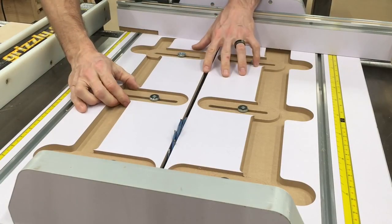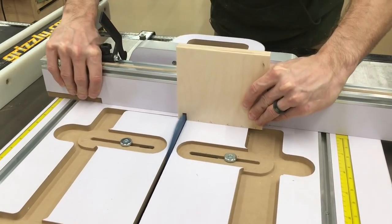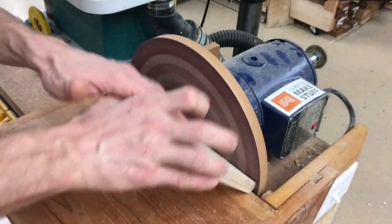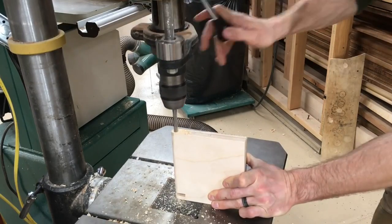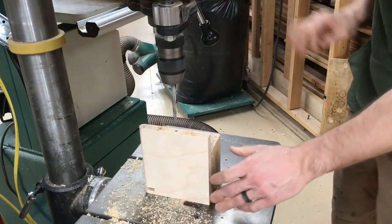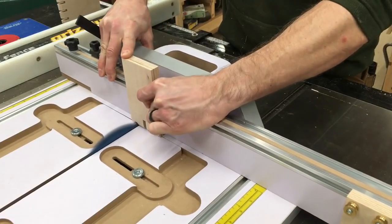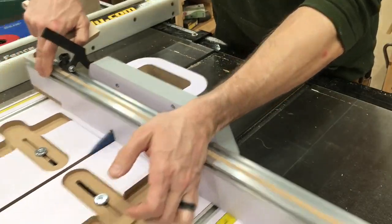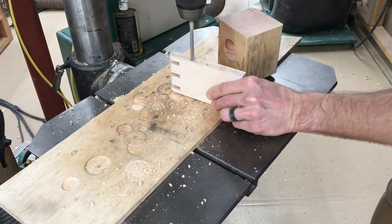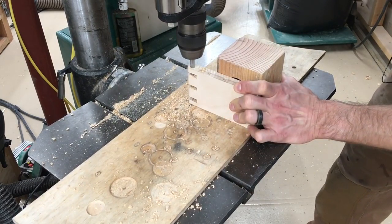And there's no better way to teach the sequence of a build than to screw it up — I'm getting things a bit out of order. I'm cutting the dado for the bearings, but after cutting one I thought it'd probably be better to drill the holes for the shaft first. So I made the half circle on the dado end of the tool body and drilled down a little more than halfway — you'll see why in a second — for the bearings and the two bolts that hold the body together. Now I cut the body in half right down the middle, making it a little extra long to account for the curve of the saw blade. Do the holes first, because as you see here, it chips out a little more than it would have if you'd drilled the hole and then done the dados.